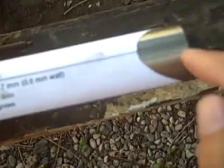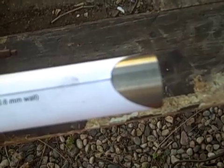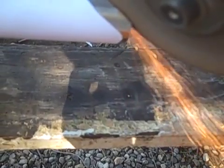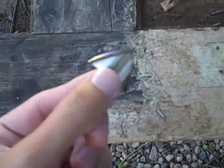The first thing we're going to do is cut a V here to take out some of the excess metal. We can do that with either a hacksaw, an angle grinder with a cutting wheel, or a rotary tool with a reinforced cutting wheel. I'm going to use an angle grinder since it's what I have handy. Be sure to wear the appropriate eye and ear protection. Even though it's called a cutting wheel, you're really grinding it. That cuts pretty easy with a grinder. Careful not to leave these little shards in your driveway — I gave my wife a flat tire once and she was not very thrilled about that.